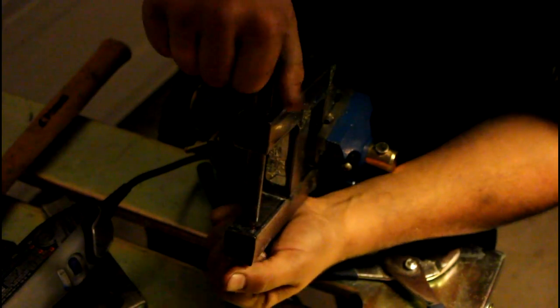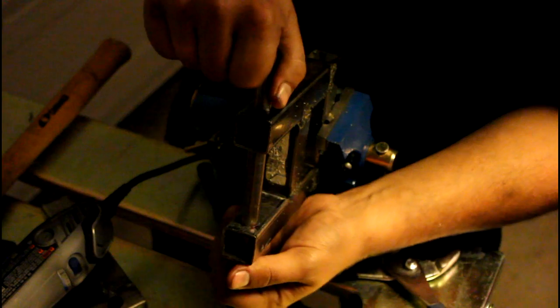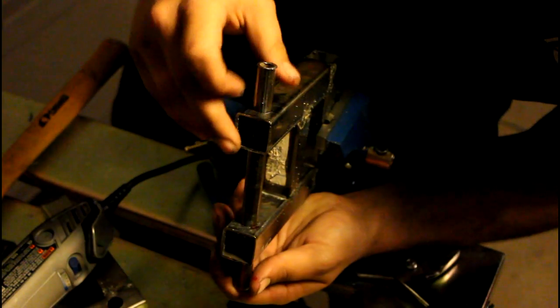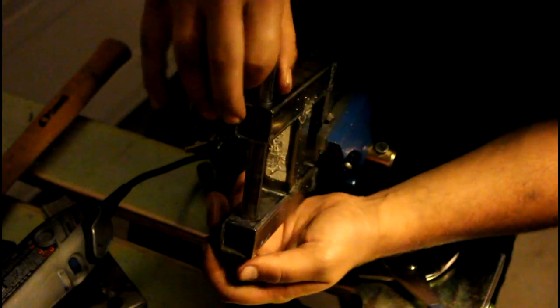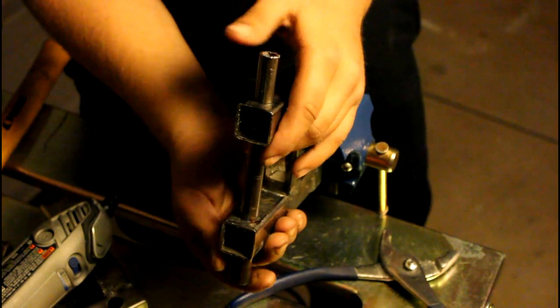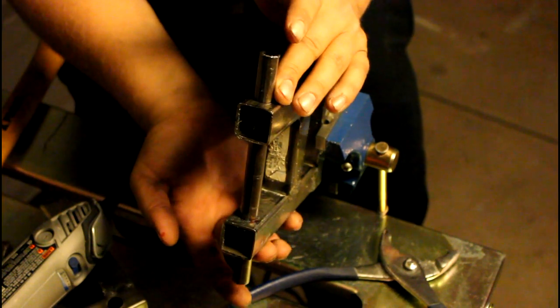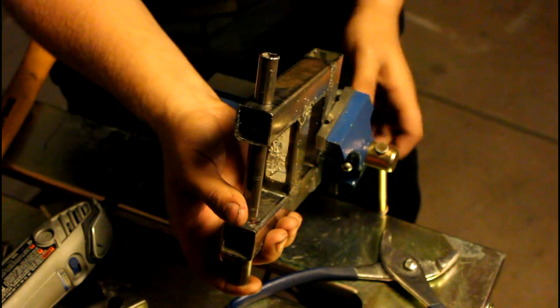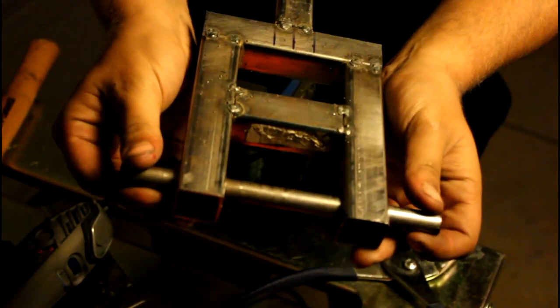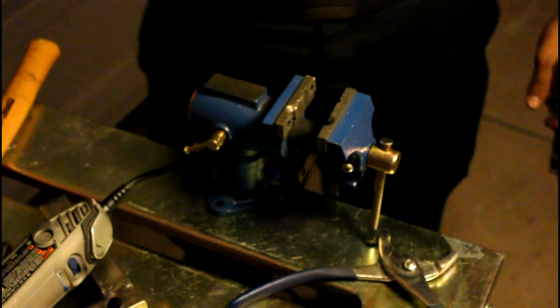Alright. So see this tubing right here, this tubing is going to actually be welded to the suspension arm, and then a bolt is going to run through that tubing to allow the suspension arm to pivot. So if you're a little bit confused on what I was talking about earlier, that piece that Will has in his hand is going to be welded to the suspension arm, and then there's also going to be pieces welded onto those tabs we were putting on earlier, and then a bolt will just run right through that. So it's looking pretty good, it's shaping up, and I have some other things to show you that I was working on the kart as well.